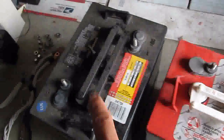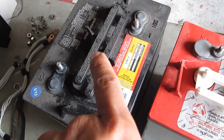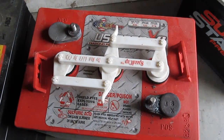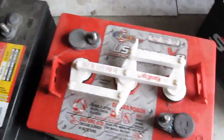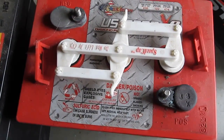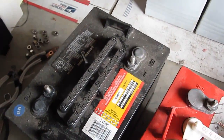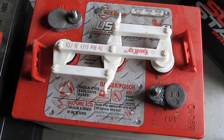So that is not good. Overcharging a battery will damage the battery too. If you leave it discharged for too long, it will be damaged, but overcharging is also damaging. So it's very important that you monitor your system all the time to pick out the bad batteries. If you have a lot like this, one of these is going to go bad, I would say, not very frequently if you have a new system, but it does go out once in a while. Let's say a couple of years or so, but you have to check it, I would say, every month, because you never know. And if you don't know, you keep overcharging the rest of the system, which is going to damage the rest of the system just because one battery is bad. So that's very important to monitor.